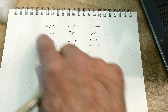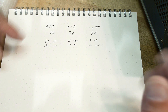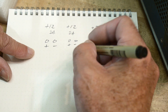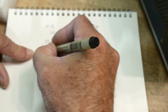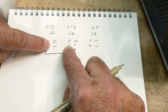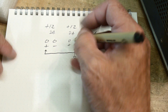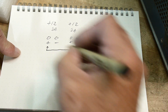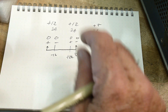One trick people know is getting negative 12 volts. You take the negative side of one output and connect it to the positive side of the other — put a short there. Then you get positive 12V here and negative 12V here, with the junction as ground. That's how you get both +12V and -12V. These terminals have to be floating, and a lot of bench power supplies do have floating terminals.